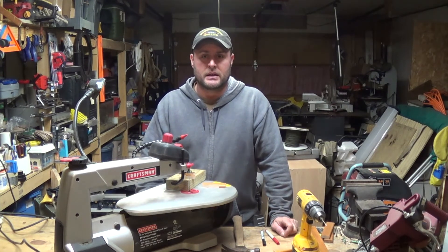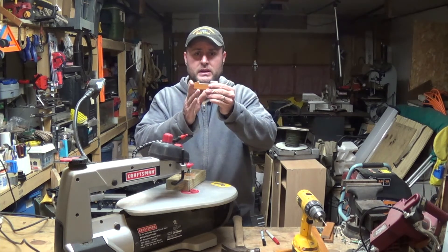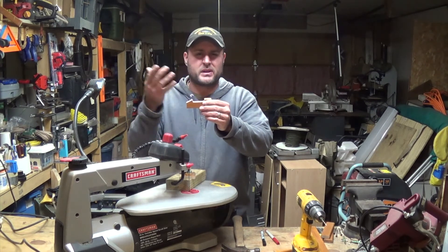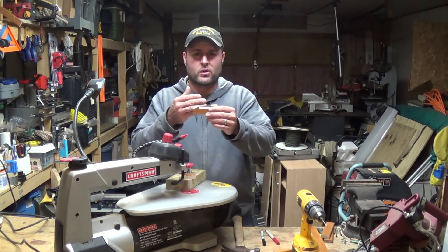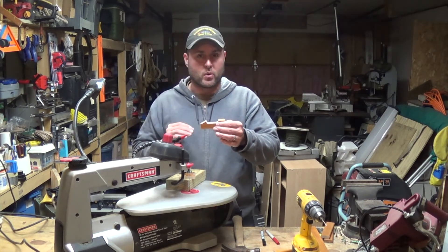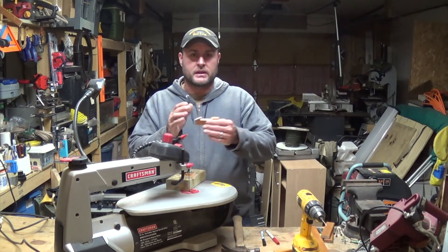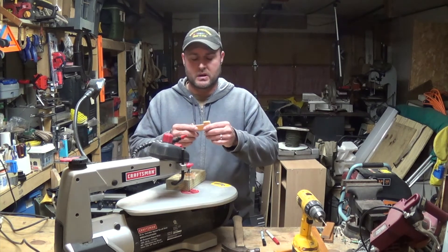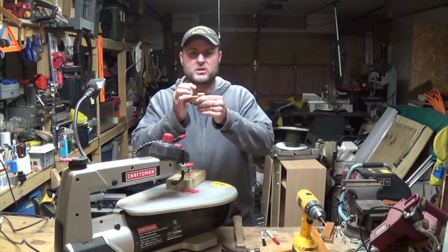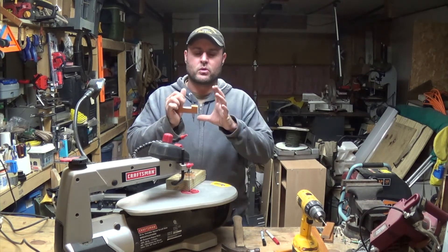The spring placement I can do off camera — it's just placing the spring and adjusting it so it hits in just the right position to both give the door something to push against and push it back out after you've pushed it to unlatch. The reason I want this piece to push against the spring is because this is going to be mounted to the gate. I could put the spring pushing against the gate itself, but it's a wooden door that's not all that sturdy, and the spring would want to warp the door unless I put one at top and bottom. So, to keep it off the door, I plan on having it push against the latch instead.